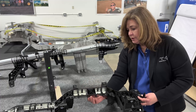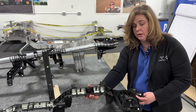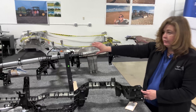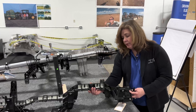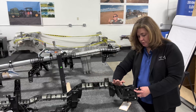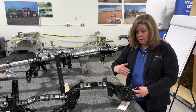Something else you can do with steel: you can choose the size of your cross section along the length. With an aluminum extrusion you have the same amount of aluminum across the entire length. But when you start with a steel blank, you can choose where you're putting a taller cross section versus a shorter cross section, so that you can optimize your mass distribution across the width of the beam.